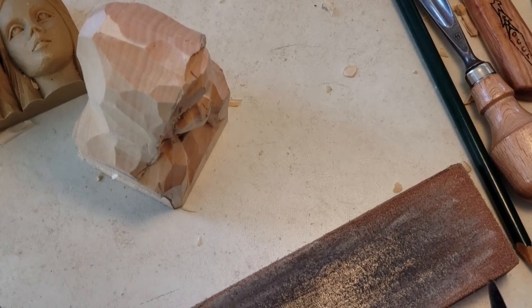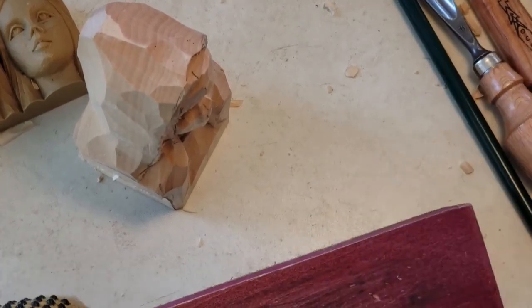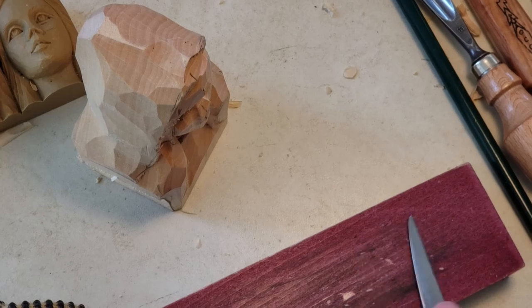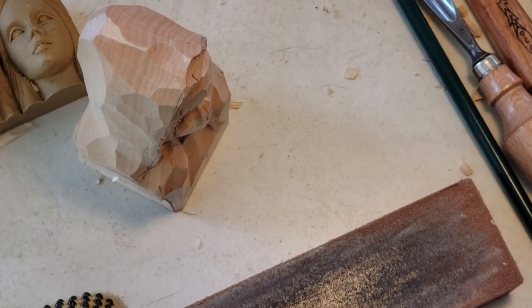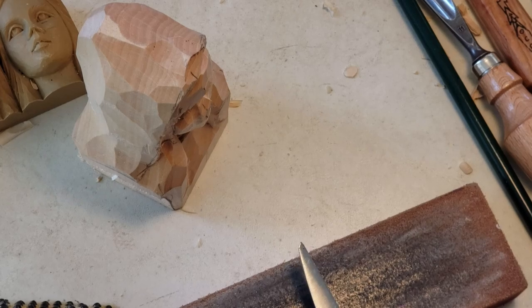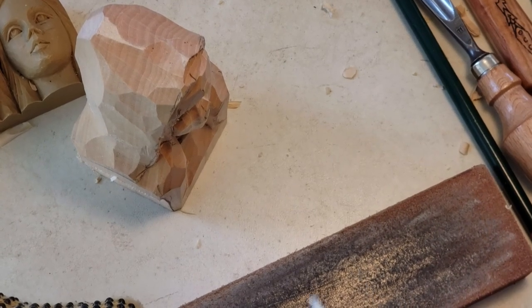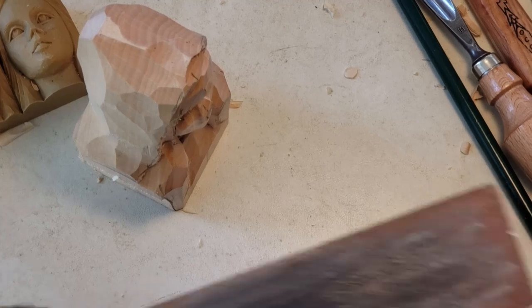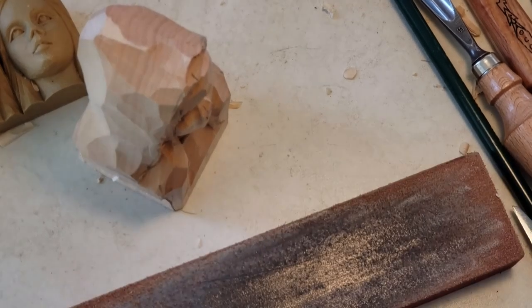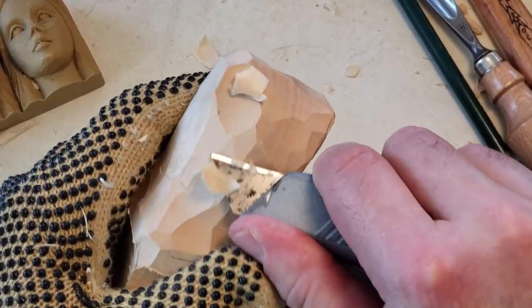The thing I like about this Flex Cut little board here for stropping, I've even gone on the other side here because there's a little more stiffness to it. You want to put a little extra edge on it. And again, when you strop it, you lay that knife flat, because as you push down, the velvet, the leather, kind of very velvety kind of thing will come up. Oh, I just haven't done this in a while for this guy, so even though, well, we're done. Look at that, that still cuts really nice. Look how nice that cuts.